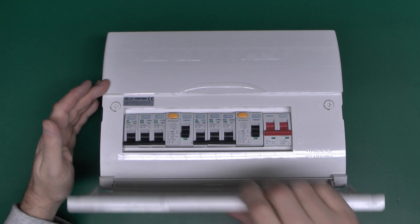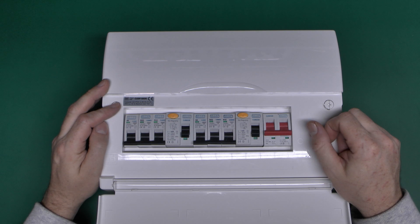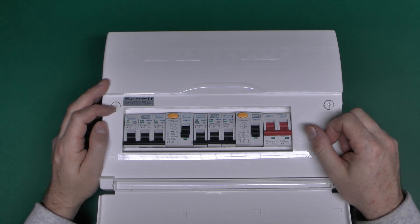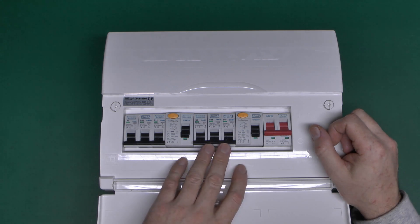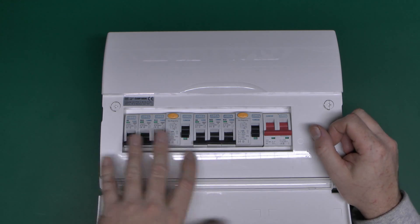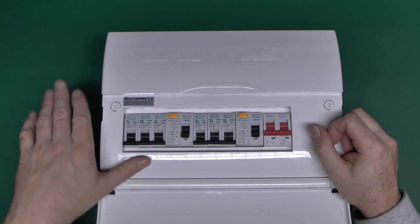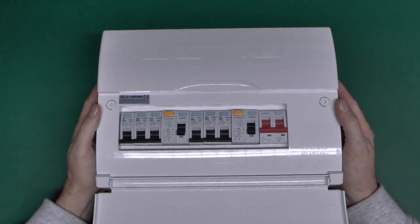This is the sort of thing that you can buy and it already comes with various devices installed inside. Typically these are sold cheaply in DIY sheds and the like, but this does seem to be the one which gets installed in the majority of properties. This particular one is fairly small - we've only got six circuits here, three there and three there. You can get this sort of arrangement with a larger number of circuits, quite often six on each side for a total of twelve. I personally don't like this arrangement of devices, but nevertheless this seems to be the most common type which gets fitted.